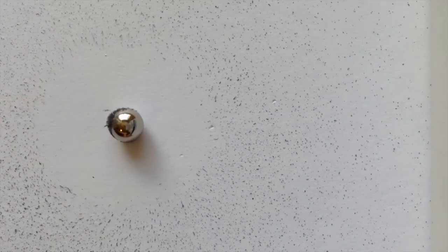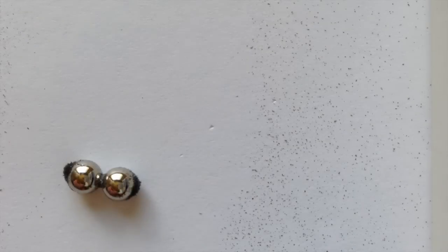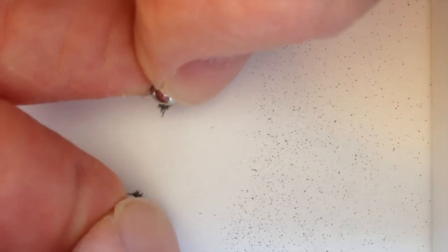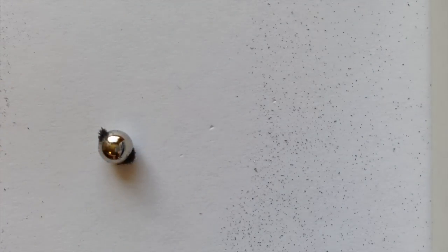The north and south poles of magnets attract ferric dirt particles. These iron particles become trapped between adjacent magnets, which attract pole to pole. As adjacent magnets move against each other, these particles quickly erode the magnetic coatings, especially at the poles. These particles find their way onto magnets from contact with dirty hands and dirty surfaces.